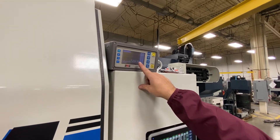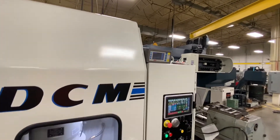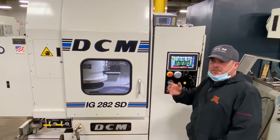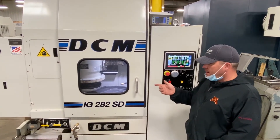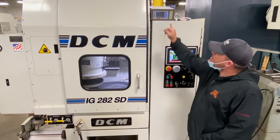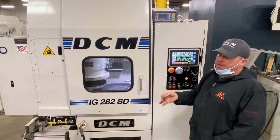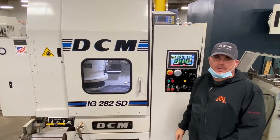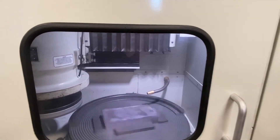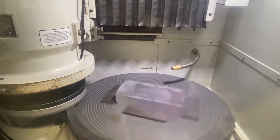As the part passes through the wheel, you get your profile on your grinding parameter. Our next feature combines all the features we've been talking about. In this scenario, we're going to auto dress the wheel — triggered by the sensor — and after the auto dress it's going to come over onto the part where I've already told it the rough part height, triggered by the sensor again, and go ahead and do its grinding cycle. You'll see right now it's looking for the sensor.